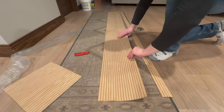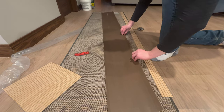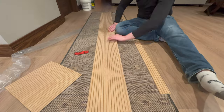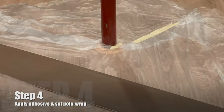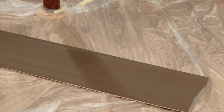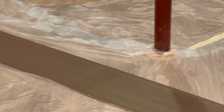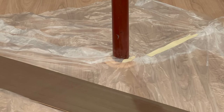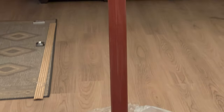Finally, we're going to go through and bend each one of these seams, getting it prepared. Step four: we'll be placing the adhesive on the pole wrap at 10 to 12 inch increments and all around the edges. You can see that I've placed one of the caps underneath to have some separation up off those knobs. Once we have it on the pole itself, the instructions say we can just wrap masking tape around it and it should hold while it cures. We'll see how this goes.